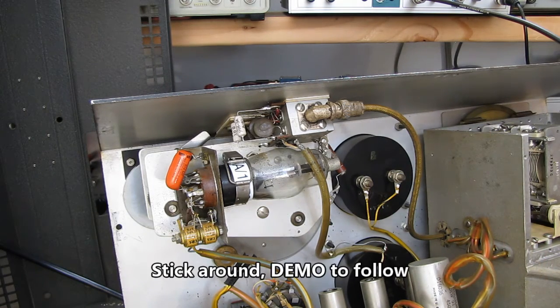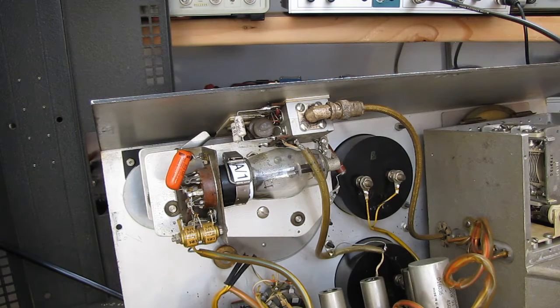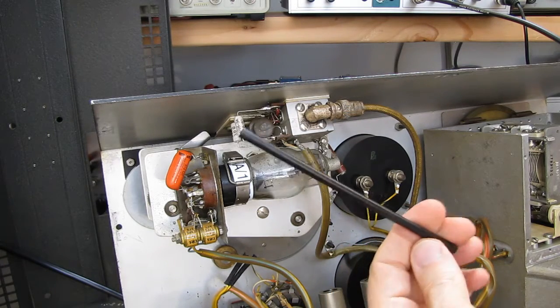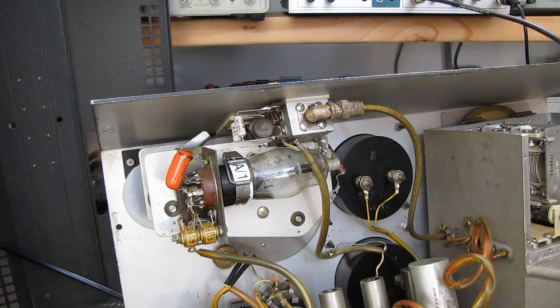In fact, you'll find out in a heartbeat: if you wind coils and stick a piece of black plastic in the center of the coil, the Q will change. If you use PVC, it probably won't. Black plastic is terrible stuff to wind a coil on. You saw what happened when I went to tune up one of the radios using one of these diddle sticks. It threw it out of tuning because this had become conductive. Black plastic usually makes a lousy coil form. There are exceptions. Delrin probably is okay.